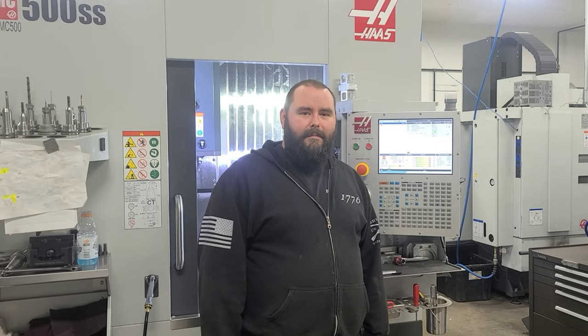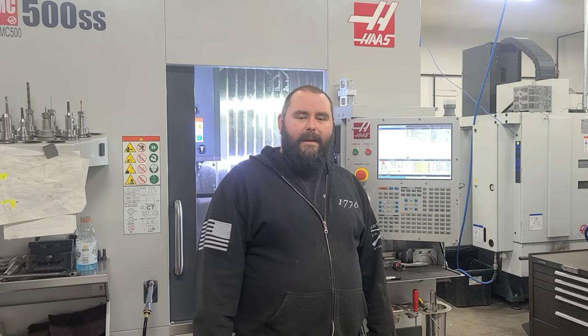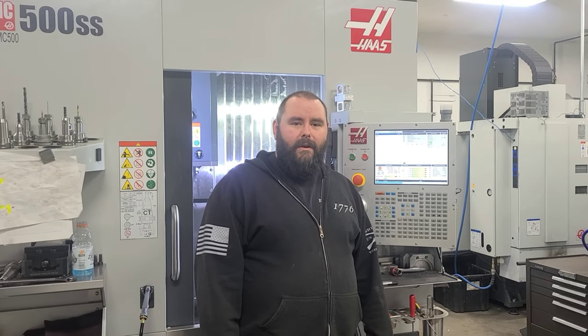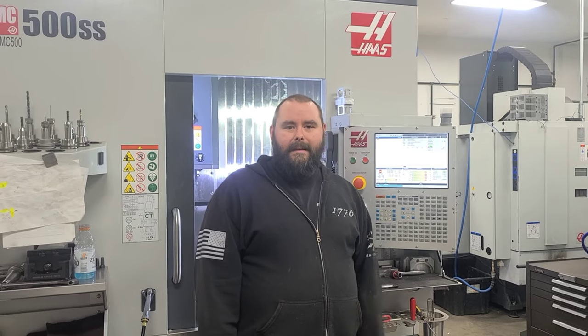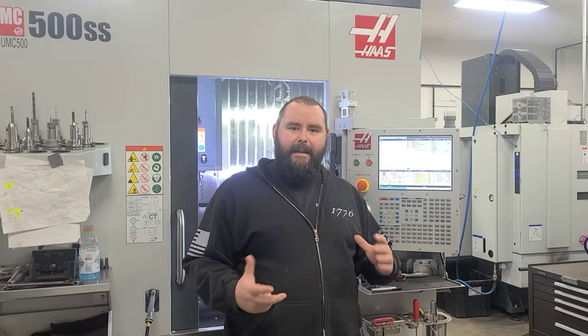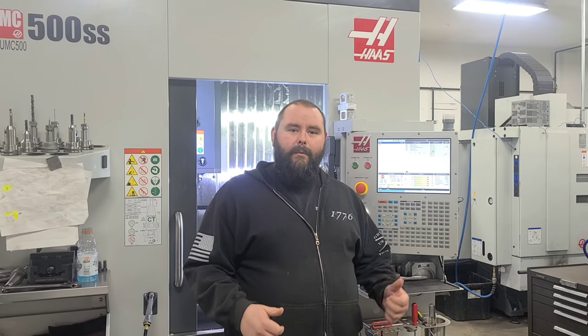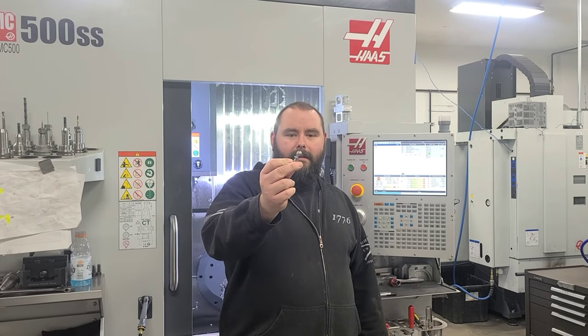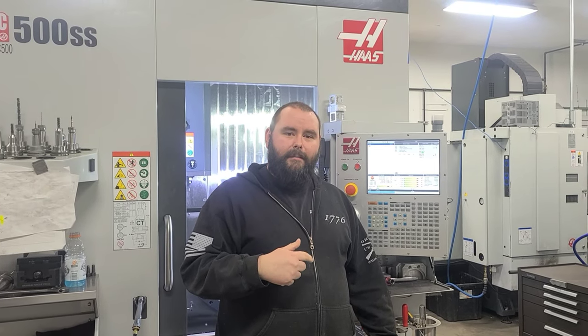Welcome back to the Pioneer Cuts YouTube channel. I'm Tim, the Ballistic Machinist. Today we've got another tip and trick for you guys. We've got some titanium weldments that we're working on, and to be able to hit all the different angles to make everything work, we've got a fixture here in the 5-axis UMC. We're going to go over using a tooling ball to pick up from one setup to another setup.